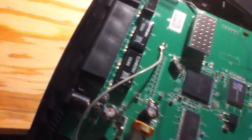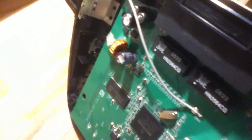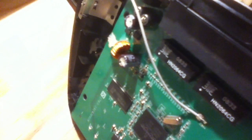It has two little capacitors that someone mentioned in one of my videos is probably the root of the problem. They don't look bad, but they could be out of spec for all I know, because the router is still functional — but it doesn't function the way it's supposed to. These are SUSCON 220 microfarad 25 volt caps. And from seeing Max Arcade's videos, I know these SUSCON caps suck.